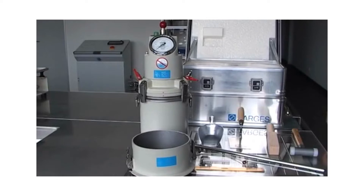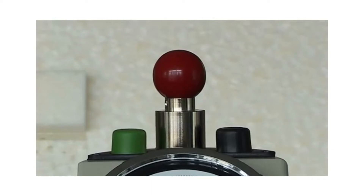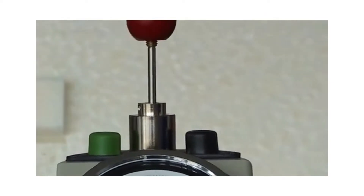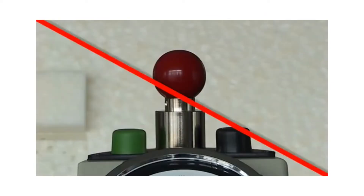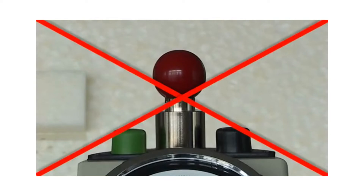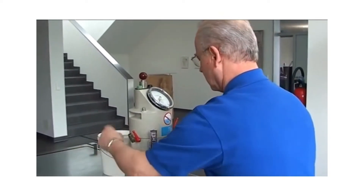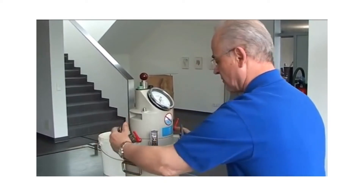The purpose of the test is to measure the air content in volume percent in fresh concrete by the pressure gauge method. All interior surfaces that come into contact with concrete must be clean and free of oil, fats, dust, grease, and residue from earlier testing. Before testing, always release the pump rod by unscrewing it. Only screw down the pump rod to lock it for transportation or cleaning with water. Never perform a test with the pump rod screwed down — it should always be freely movable. Remove the cover assembly and wipe the interior surfaces of the container with a soft sponge.